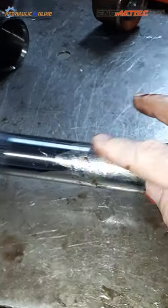So the next thing is the rod seal. Wiper seal. Oh, so the blue thing is the rod seal. This is the wiper seal. It's pretty self-explanatory, although to be sure, this edge faces pointing up, so it's wiping. These ones are a lot easier to get in. There you go. So that's now in there.